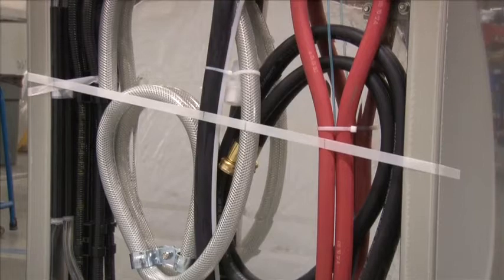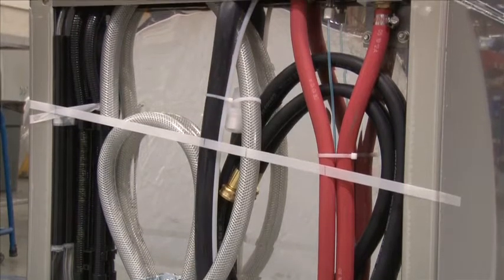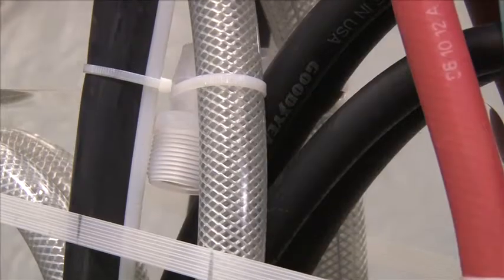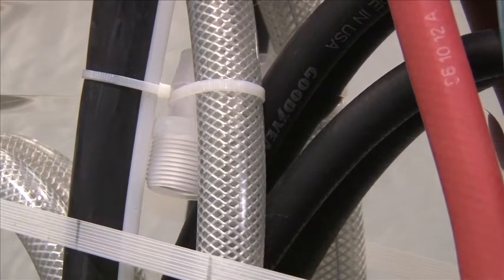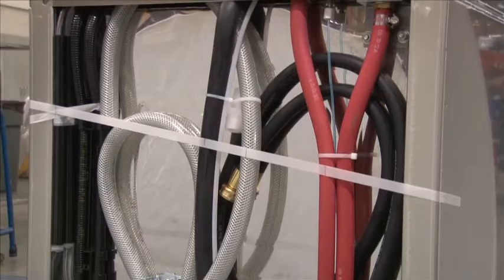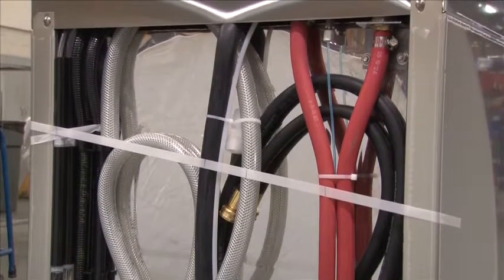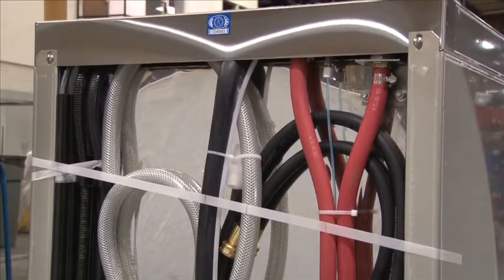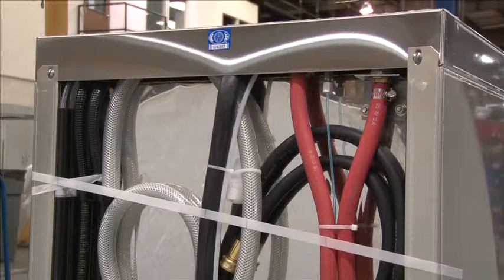You will untie the drain, and you will attach one end into a Y fitting that will be provided by the customer. We will provide the 3/4-inch slip fitting that will connect to the Y fitting, and your drain hose will attach to that. Also, make note when you are installing the drain line, it has a maximum of 3 feet from the ground. A good reference is, do not run the drain line higher than the level of the machine. This is for reference.